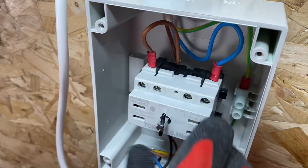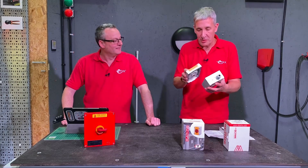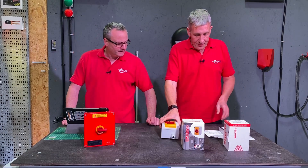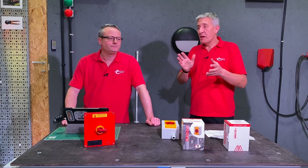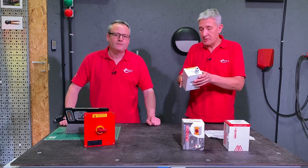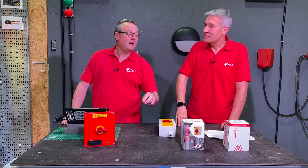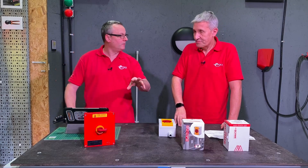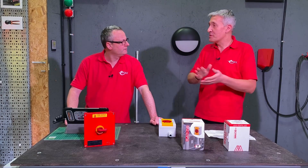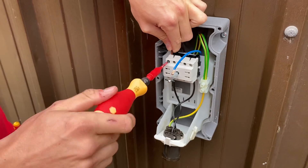There's really only one position the switch can go in — unlike some where a DIN rail lets it slide and you can't line up the mechanism. This one: as long as it's in the off position, you're locked in and ready to go. For current range, the smaller enclosure goes up to 20 to 40 amps, and there's a larger size up to 63 to 80 amps. Pole options include two pole, three pole with switched neutral, and four pole. We'd be interested in your thoughts on the difference between three pole plus neutral and four pole — comment below.